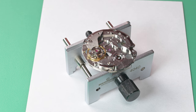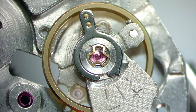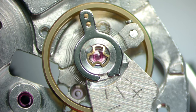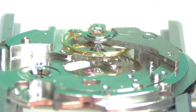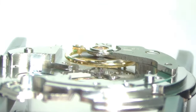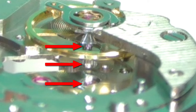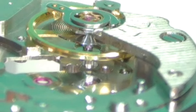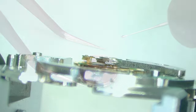Now we're looking at this balance after getting it all put back together — that hairspring is looking good, breathing really well. Just double-checking the flatness: if the hairspring was bent you'd see it lifting up on one side, but that's looking really flat. I also want to check the placement of the impulse jewel with the balance at rest. Zooming in — the impulse jewel is up top and the jewels for the pallet fork and escape wheel are below it. They're all in a straight line with the balance at rest, close to center, which minimizes beat error when you first bring up the watch.